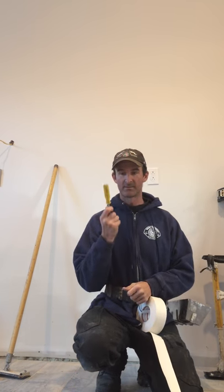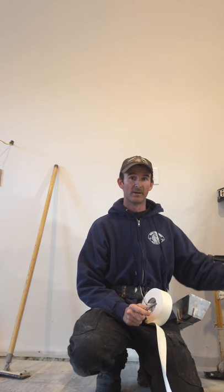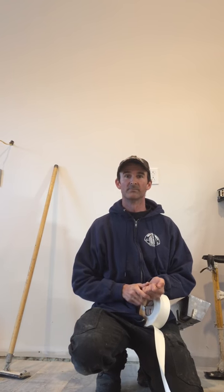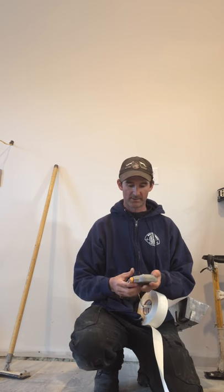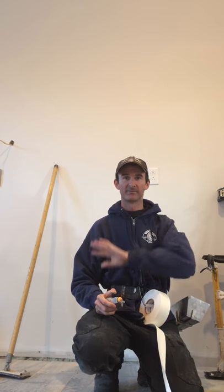Some other tools I carry: a screwdriver. There's always a screw sticking out somewhere, and rather than put my tools down and go get a screw gun, I carry a screwdriver. It's usually just a quarter turn the screw has to go in, so it's a lot easier to grab the screwdriver from your back pocket and continue with your current job. I also carry a chalk line to straighten out open corners — splayed corners as they're called. The eye will always catch a straight line, and if the line isn't straight the eye will catch that too. I'll snap the chalk line from one end to the other and then feather it out where it needs to be done.